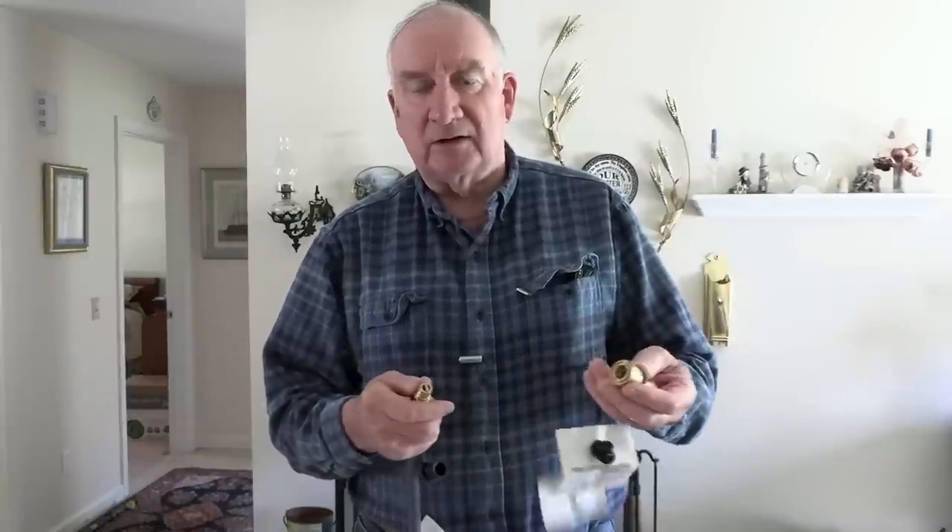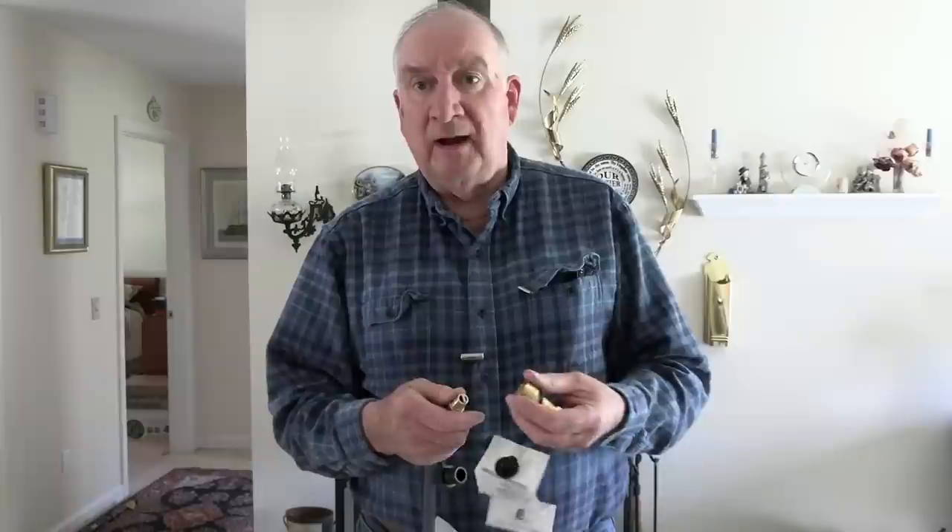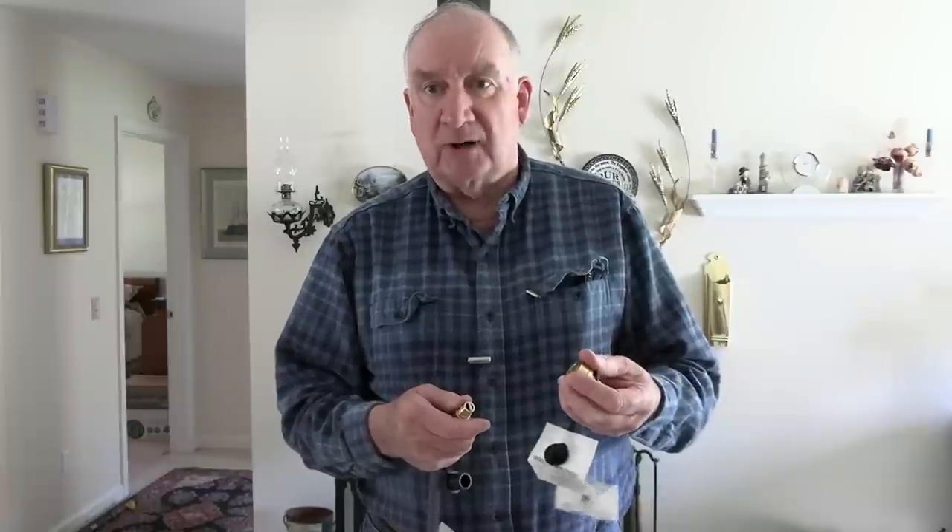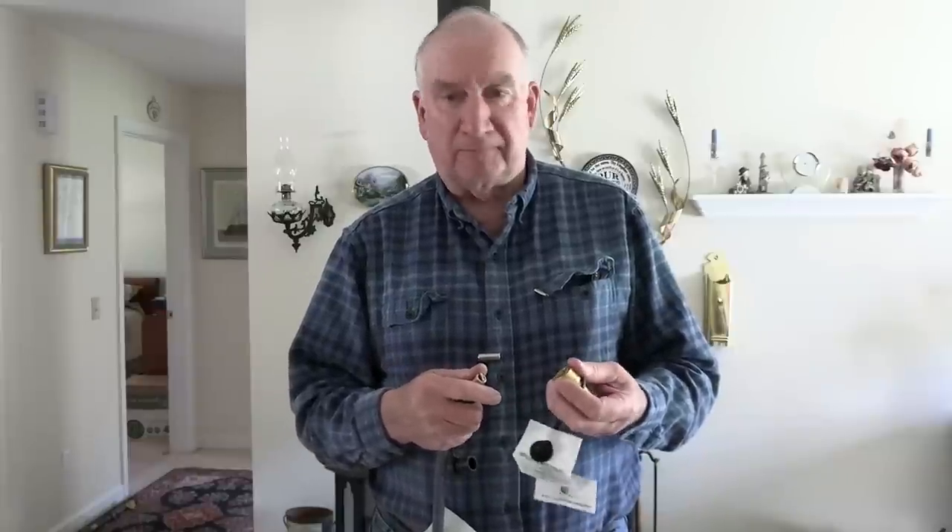Just to be safe and for just a few dollars more, I'm going to run 3/4-inch black iron the entire way, except for just the last 30 inches, which will be half-inch pipe from two different locations so I can have the grill at one end of the deck or the other. So let's start the project — I'm going to go down to the basement.